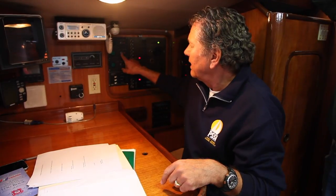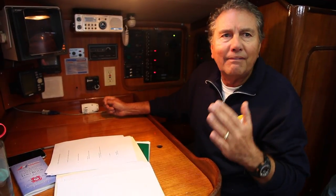We also have an inverter on this boat. An inverter pulls from the 12-volt batteries but kicks the 12 volts up to house current — 120 volts — so we can plug in a toaster, microwave, or blender. But I try not to run the inverter unless I'm also running the motor to charge the batteries back up. We have had students with sleep apnea machines running on the inverter all night — it actually doesn't use that much power and the batteries were okay in the morning.